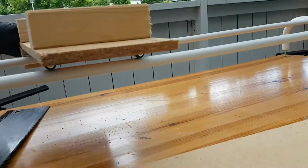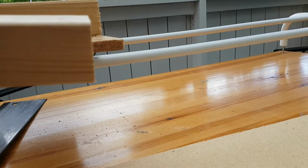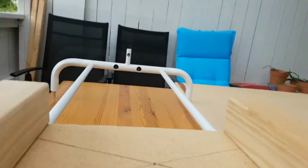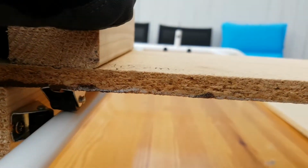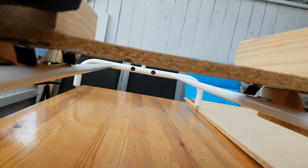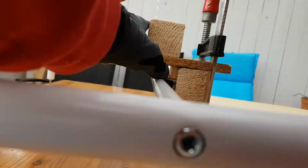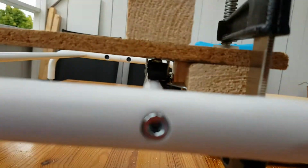I placed the platform on the rail and clamped the side to the platform. Make sure you use a clamp that doesn't shoot off your camera. And also, make sure the wheels on that side sit tight against the pipe. All other wheels should too. Test if it rolls smoothly, without side bobble. If yes, then re-secure it with screws after pre-drilling.